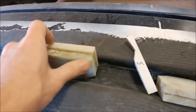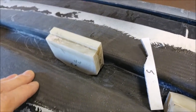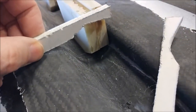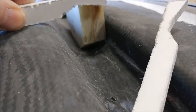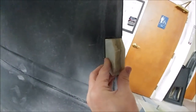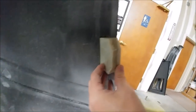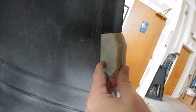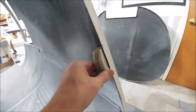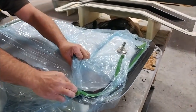Back to a door frame — this is the first one laid up, and the next step is to bond the hard points into place. We decided not to do it during layup; it's easier to do after the fact. But they all need to be trimmed first because when I created them I wasn't sure how tall they needed to be. I've drawn a profile off the inside of the fuselage and created little templates showing where to cut, reducing the height so they'll fit in nicely. There are a couple of places where we had core inside the door frame that needed to be cut out. The next step for next week is to trim those off and bond them into place so the frame fits in the fuselage.